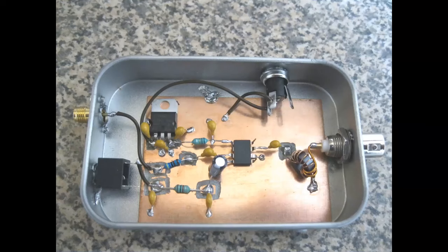So here it is. Now, this is built, I don't know what you'd call it. It's kind of a variant on what's known as the Manhattan style. Now, the pure Manhattan style uses little pads that you glue down, which are isolated from the ground plate. So your ground is that single-sided copper board. So that's easy, just solder them down to ground.